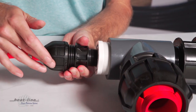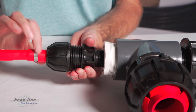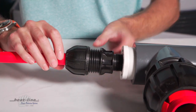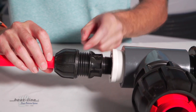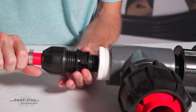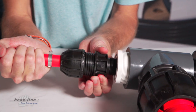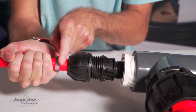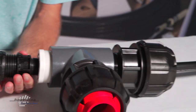What's important here is that this nut is spun loose. What we do not want to have happen is we do not want the tubular heater to start spinning inside as we start to thread this on. So what you're going to see is I'm threading that fitting in without this tube moving — this is just ensuring that we're not twisting the heating cable inside.